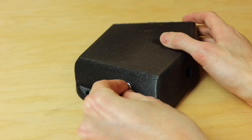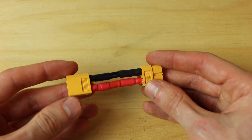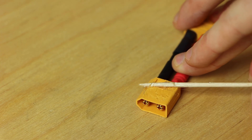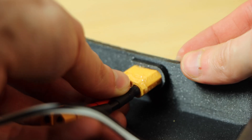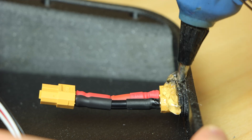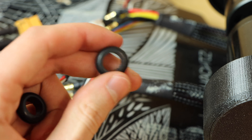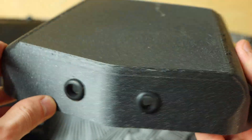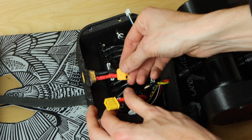To begin the rear enclosure assembly, I mounted the power switch by inserting it into the hole and using the nut to lock it in place. I then made an XT60 cable harness going from the front enclosure harness into the Focbox Tanka. I put super glue on the XT60 connector and slid it into the XT60-shaped hole I 3D printed into the rear enclosure, then added hot glue to make sure it was secure. I also added waterproof rubber O-ring grommets — something I'd never tried before — installed into pre-designed holes to cover the phase wires where they enter the enclosure. I then routed the phase wires into the rear enclosure through those holes and installed the ESC to get a rough idea of fitment.